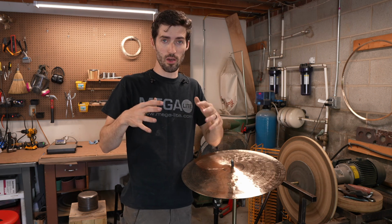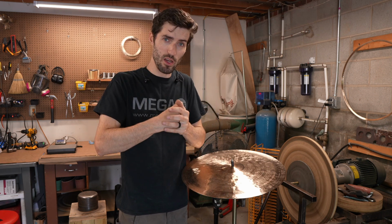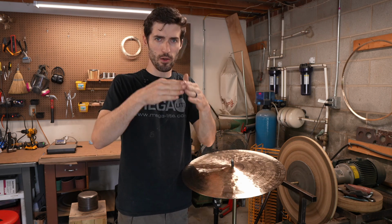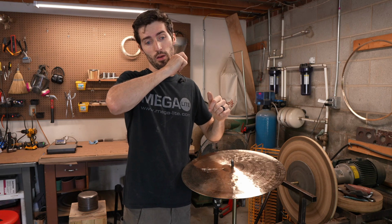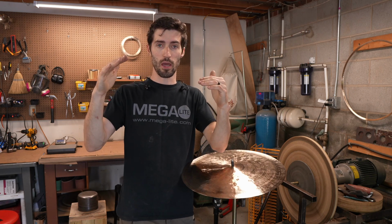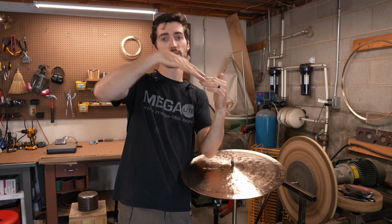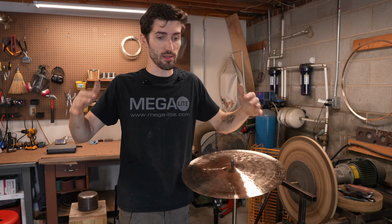So if your bell on your ride is like a pressed bell and you hit it and it just feels super piercing and clear, it's because that hard edge is making it to where that sustain can't continue through the body of the cymbal. If your bell is gradual and slopes into the body of your cymbal, you hit the bell and then the whole cymbal activates. The sustain is just flowing right through that transition.